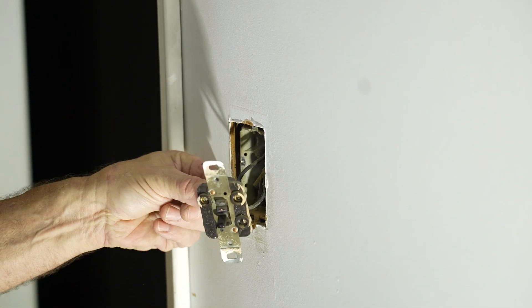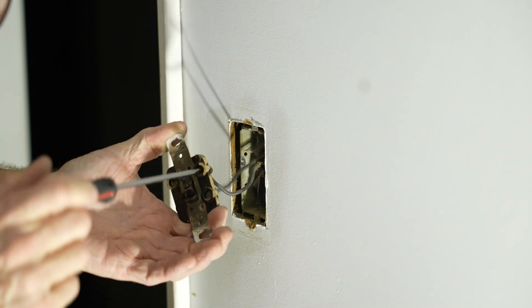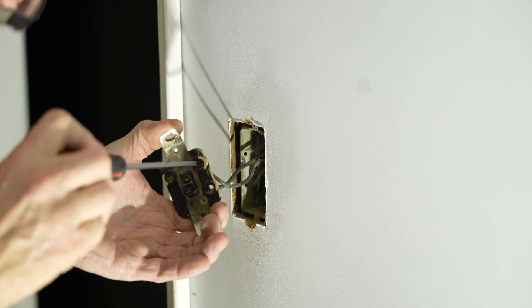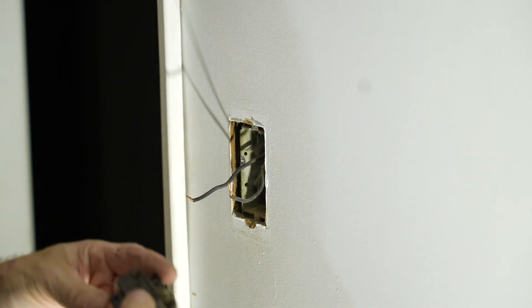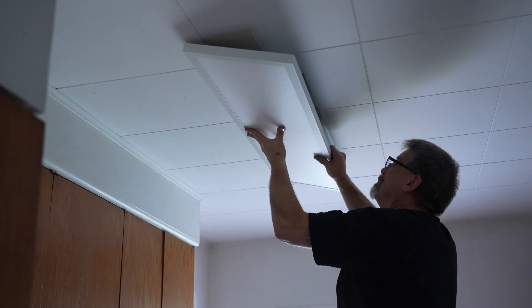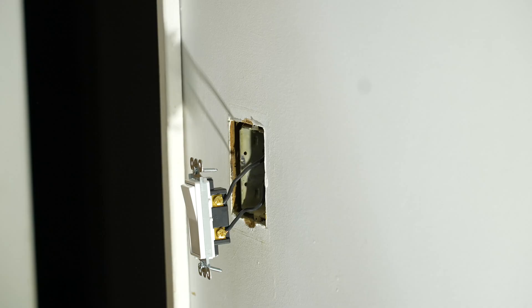That wasn't too dangerous at all! The way you get the wires out of here is you turn the little screws in the front. You saw that wire fall right out of that switch. This is why I'm personally checking every plug, every switch, every fixture in this house. If it's been sitting there for 70 years something's bound to come loose. If some yahoo changed it out, I don't know the quality of his work. I just feel a whole lot better if I replace stuff like these switches that I'm going to use on a regular basis, and double-check all the plugs and fixtures to make sure there are no loose wires arcing.